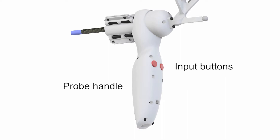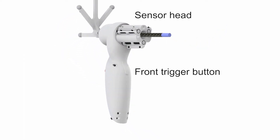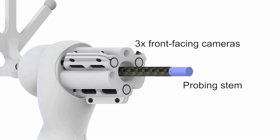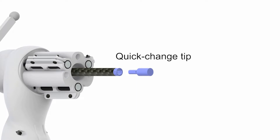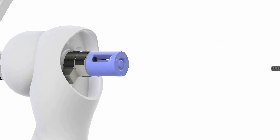Buttons are integrated into the probe's handle to allow single-user experimentation. 3D motion tracking markers are used to locate the probe. Sensors in the head of the probe include three cameras which capture tissue deformation around the probe shaft. A quick-change tip allows for different modes of contact in future experiments. Cameras are placed to capture a 360-degree view around the probe tip.